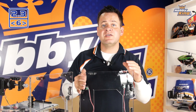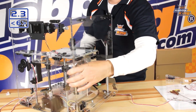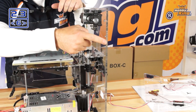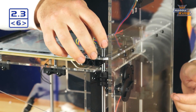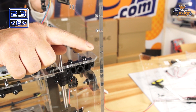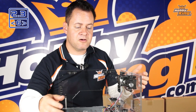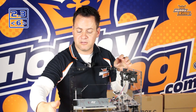This panel needs to be left looser than the other side. The reason is there's a small chamfer where this panel meets the back panel, with a little gap, and we'll be routing some wiring down through there as we bring this panel in tight. Leave it loose enough to fit the wires through that chamfer. The procedure is the same — install the rod, slide it down, and as I slide it down I'll put the rear sensor wire through the chamfer before putting in the screws.